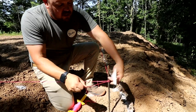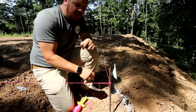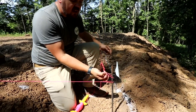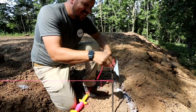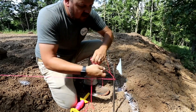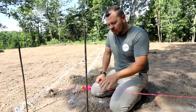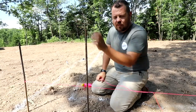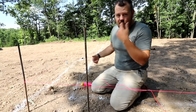My stake is shifting just a little bit but I'm not worried about a tiny bit of movement here — this will be much more stable when we're doing batter boards. So again, six twists wrapped around the stake, lift it off, pull parallel with the line, and it's free. We have our string line here pulling from the corner. We've taken a Sharpie and put marks on our line measuring the 24 feet. We've staked at 24 and 26 feet at both ends because we have an offset and want them straight all the way across.